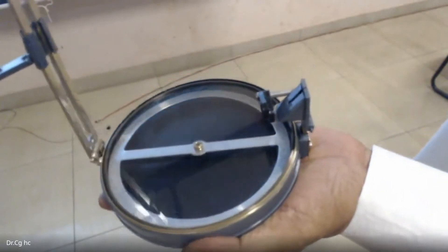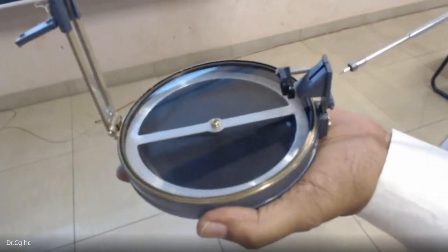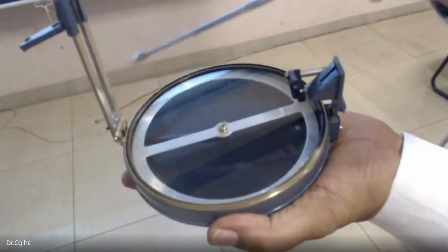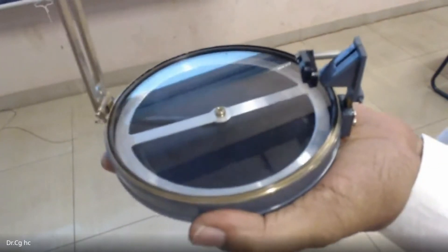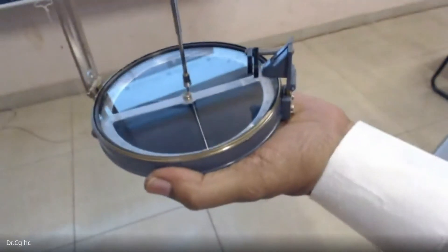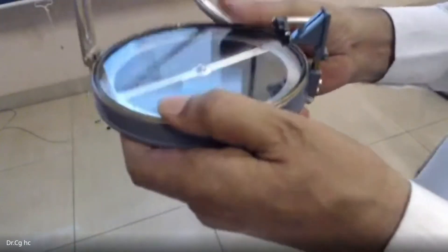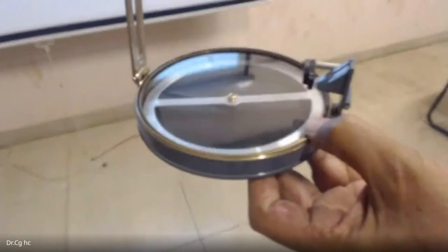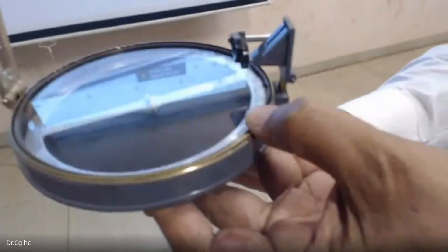When we look through the prism, we sight the ranging rod. The line of sight, the cross-hair, and the ranging rod should all be in the same straight line — the survey line. We install the compass at the station, level it, and rotate it to bisect the target.